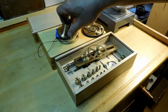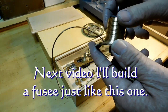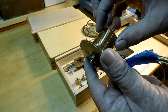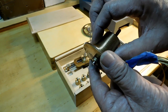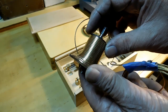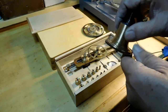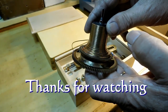I'd like to talk about the next video. This is a fusee from one of my other clocks — you can see it's mounted on a great wheel and has a curve with wire running in the grooves, connected to the mainspring. It allows the spring to evenly dissipate power: when first wound and strong it gives a little power, and near the end of the eight days when it's getting weak it compensates — that's really important when using a compound pendulum. In the next video we'll be making a fusee, cutting that curve and all the grooves with a shop-made tool. Thanks a lot for watching and I hope to see you at the next one.